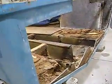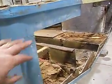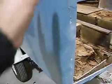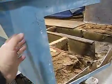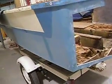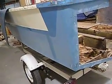We might even suggest that where we're going to have to blend in here, well, obviously it's going to be tough for us to blend in the gel coat and get the colors exactly right. So another thought would be, on the back or in this corner, that you might want to have some kind of graphic made that covers that. And if you have two colors that are slightly different from one another, but you have an inch of space in between them, especially if that space is white, then the color difference disappears.